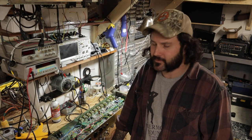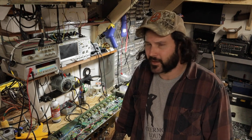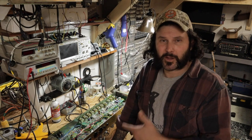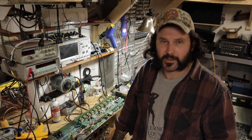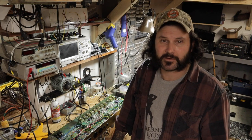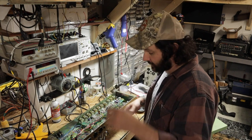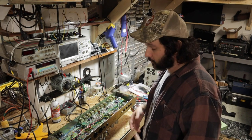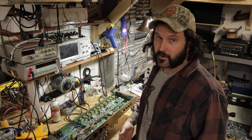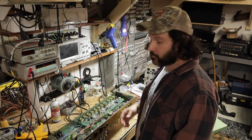I've read a lot of comments about us just replacing electrolytics that don't need to be replaced — but that is a complete crock of shit. The dielectric compound within the capacitor dries out over time. It's not a question of if, it's a fact. The amp is damn near 40 years old. I'm not going through the hassle of putting all these capacitors in the ESR meter — I know they're old, they've got to go. It's not hard, it's not expensive.